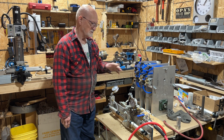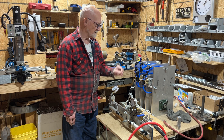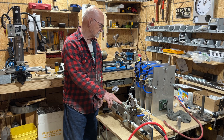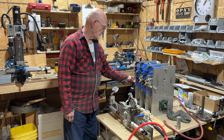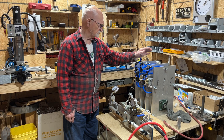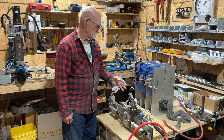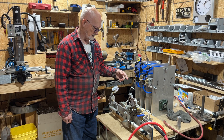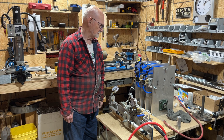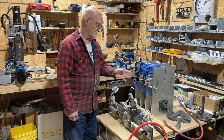I've done some work in between trying to get things completed. As you'll see later on in the video, I ran this and it runs pretty smooth. It doesn't go too fast. I do need to do some more work on this — I think I want to take it apart and make new rotors and rings to make it a shorter stroke. The way it is now it uses way too much air, so I'm going to just set it aside for now.